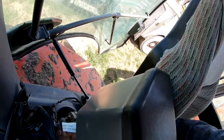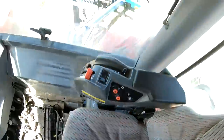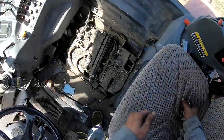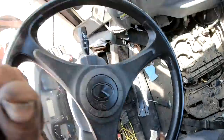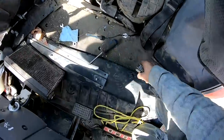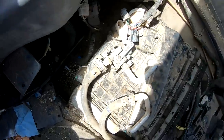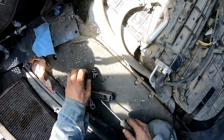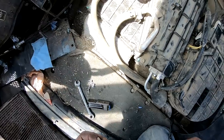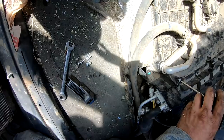Like right now, I'm going to do it. I mean, I got the time, so we're here. Drove all the way out here. You might as well do it. But I've had customers standing right there, and I've told them, you want to sit here and wait for 30, 45 minutes for the vacuum, or do you want to charge it and get going? I tell them, it's a pretty dry climate. I haven't really had any problems, but if you want it done that way, then it's on you if it builds moisture in the system and destroys it.